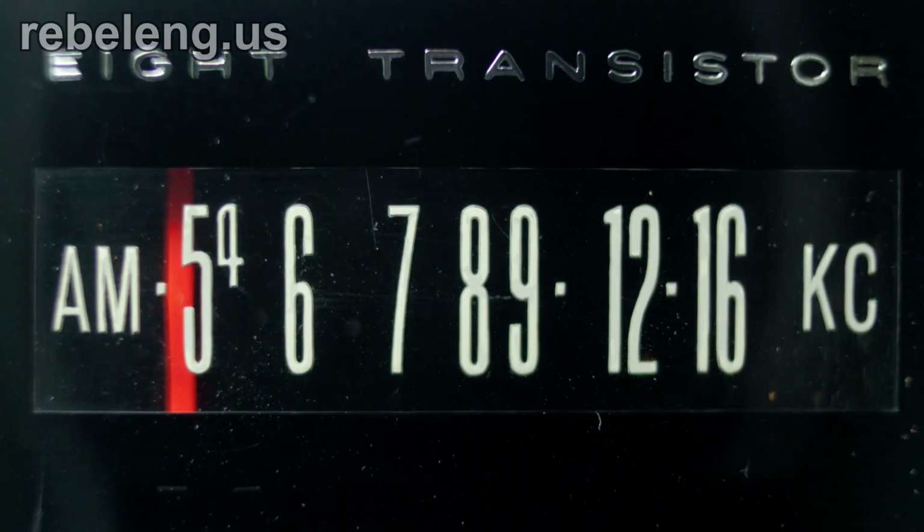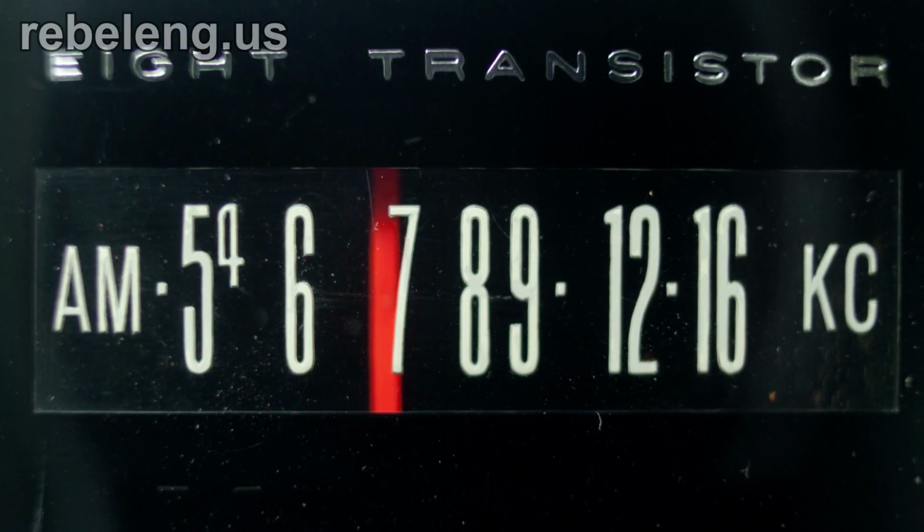Furthermore, they should not be used on any type of CNC machine, as the high frequency discharge will cause electrical noise interference and possibly damage the computer and electronics. This is similar to how you can get interference through your stereo system from the ignition on older cars. You are just asking for problems trying to use a high frequency plasma cutter on any DIY CNC table.